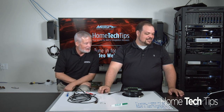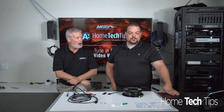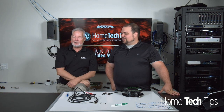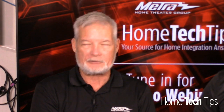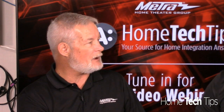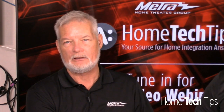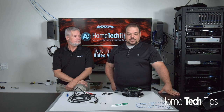Another question. What do we got? So the next question is: conduit underground typically holds water. Will the jacket resist this? Yes, the cable does. As long as you have an undamaged jacket sitting in there, you should not run into any issues. Just don't leave the electronics there. And the Plenum, if you're really concerned about that, the Plenum takes that even further. Exactly. The more shielding you can have on that cable, the better.